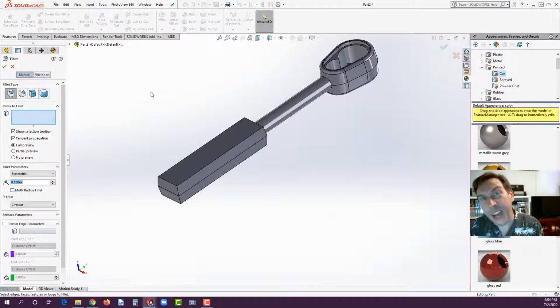But also it's for manufacturing, especially when this is compressed in this mold. You want to have radiuses everywhere so that the material could flow. There's more to it than that. And there's also aesthetics. It just looks nicer in some cases. There's multiple reasons for fillets other than just one item.